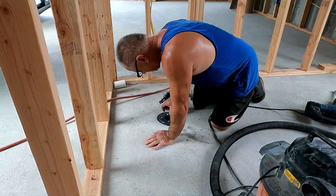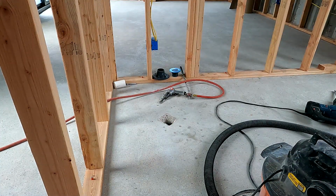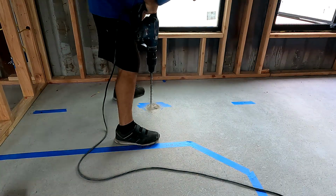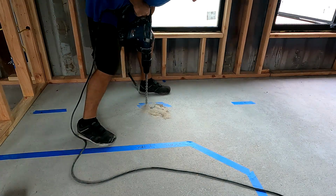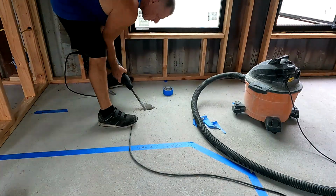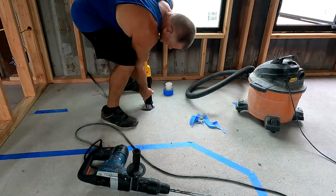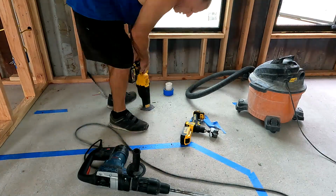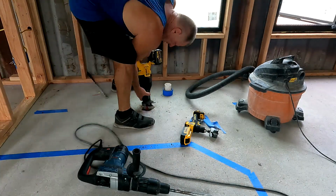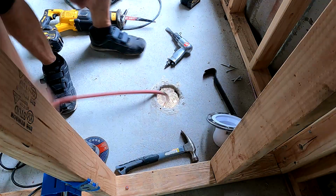Anyway, here I'm doing just a regular old drainage, a typical shower kind of drain. Just made it big enough so I can get it down there. Went underneath, cut the hole out, etc., and glued that thing in. Here you see me starting to put in the drain for a standing tub, and it's roughly, I think, 67 inches long, and the drain's right in the middle of the bathtub, so I'm making the hole for that. That's the initial hole. I'm just going to rough this one in, and I forgot to order the actual fitting. You see the Sawzall making smoke right there. That's pretty cool. The 1-inch plywood that's underneath there is pretty solid.